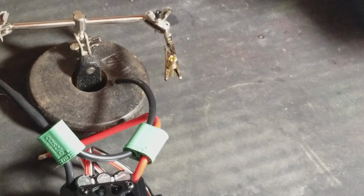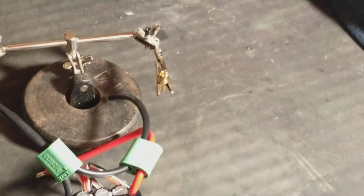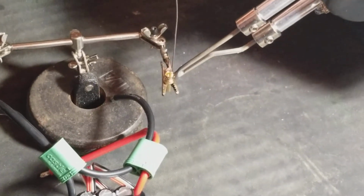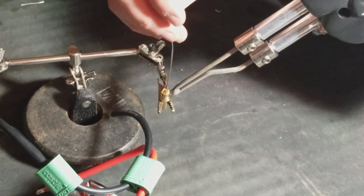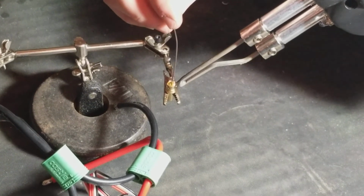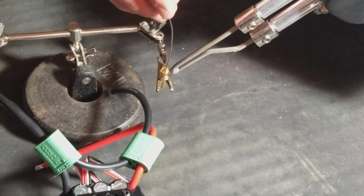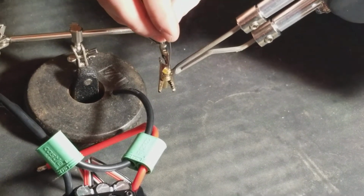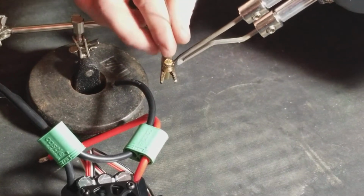That's all that matters. Now, you may need to cut another piece of solder. I probably have to. Let me clean my tip again. Now just hold it in the center, in the bottom. Just let it melt. Having quality tools does pay off. It really does. And don't try to jam this in faster than the stuff can melt. Just let it go in normally.